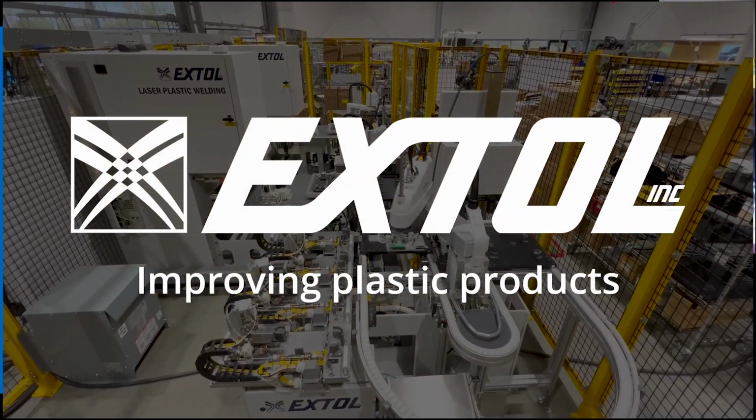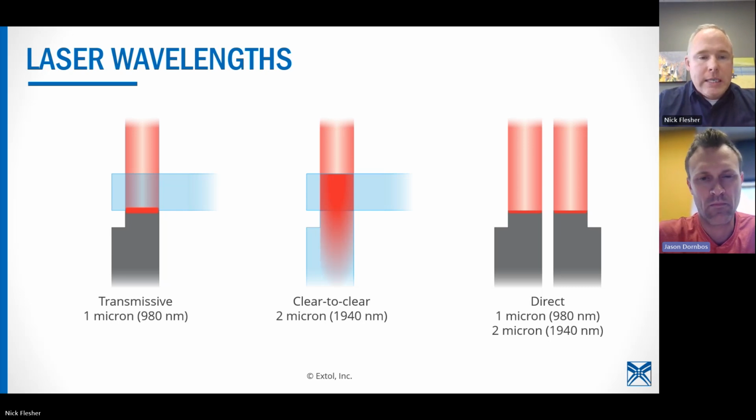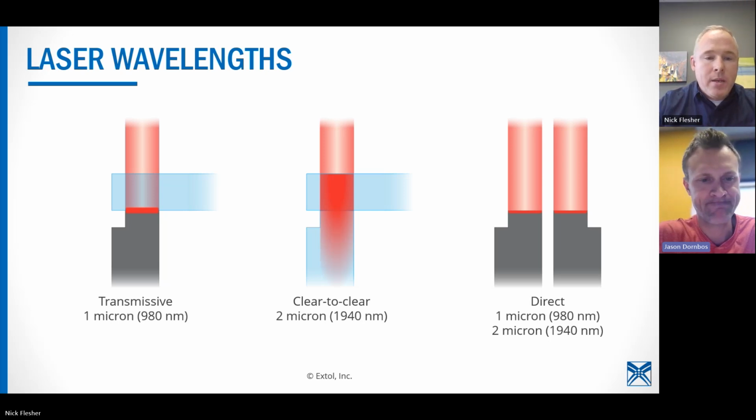All right, let's get back into the technology a little bit. Those are just a couple of examples where we wanted to show a different part of the process on video 1. Video 2 is just different ways you can think creatively around that. We did a lot of things on that second video for cycle time. The customer had throughput requirements. So for example, the 2 lasers happening at the same time, you notice the annotation on the video. That was because we needed to put a lot of power into the part, and we didn't want to burn, so we sort of broke the power out into two lasers for that. We'll talk about selection of equipment in a minute based on throughput, budget, things like that.